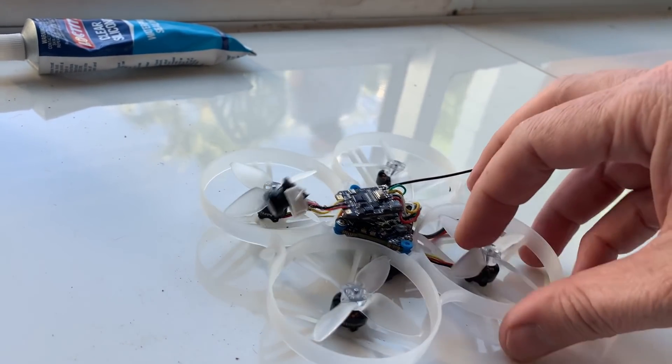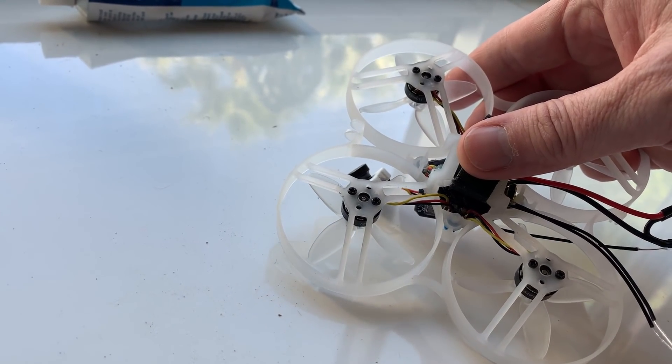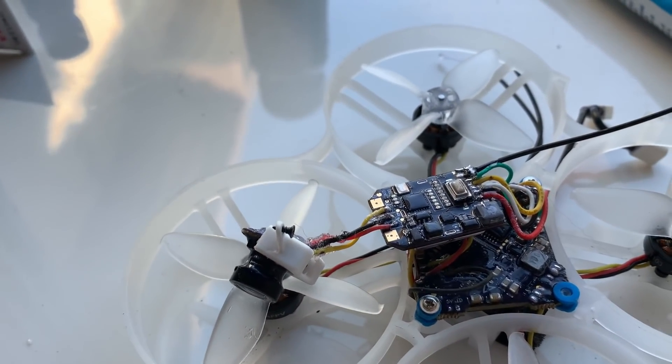The electricity is the real problem, not the water. Water conducts electricity, but fresh water like this only conducts it a little bit — there's still quite a bit of resistance. If you had a power lead in the water and a little bit of current was leaking from one side to the other, that might drain your battery a little faster than normal, but it's not going to cause a catastrophic problem. The bigger problems are going to be in the more sensitive parts of the electronics — voltage from the 5-volt line or from VBat getting into the processor, the OSD chip, or any of those lower voltage signal wires. That's where it could really fry something and cause permanent damage, which is why we need to cover all of those electronics in silicone.